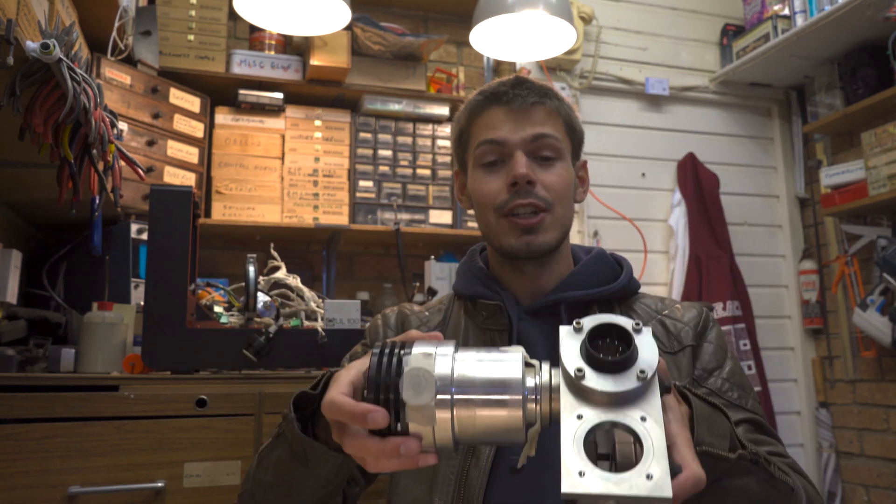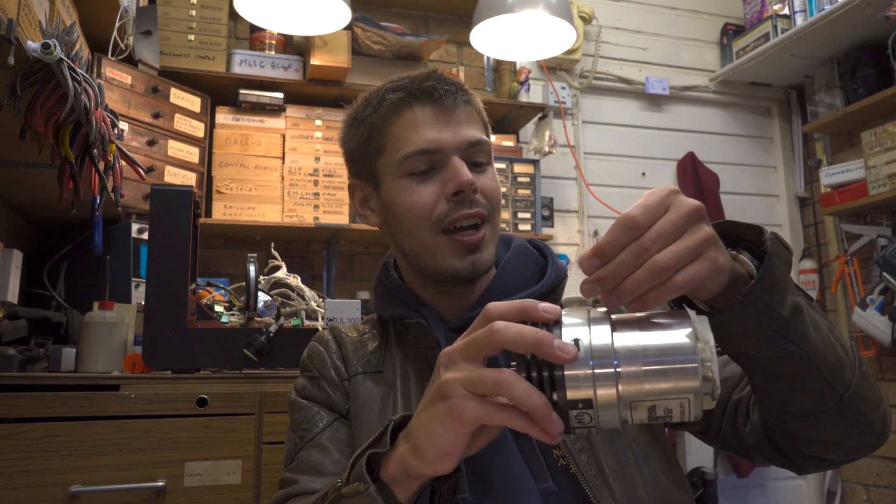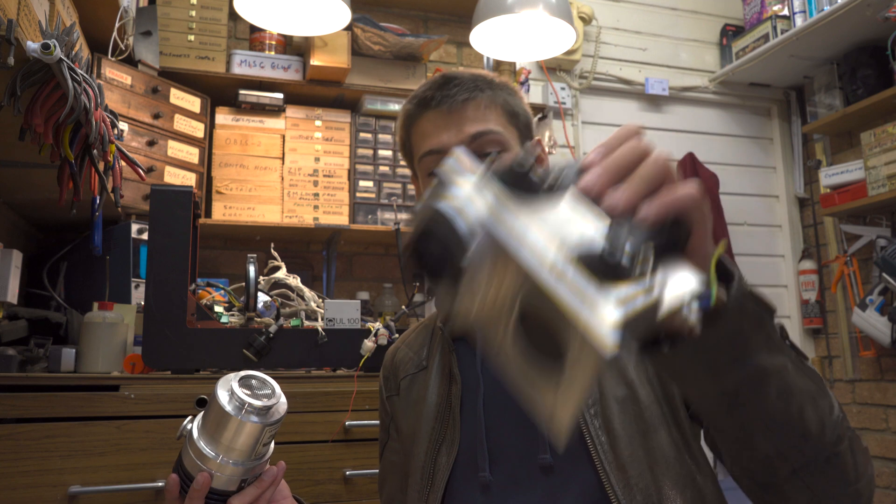So how do we make a high vacuum? You use a high vacuum pump. This is a turbo molecular pump, which is basically just a fan that spins really really fast to impart kinetic energy into the molecules of air, in hopes that they will bounce out of the chamber. This is attached directly to the mass spectrometer and sucks all the air out. This fried my noggin for a bit because in the mass spectrometer there are no other holes or ports for helium to get in — so where does the helium that's going to be detected enter? It turns out it's via reverse diffusion, because helium atoms are so small they can actually diffuse through the pump against the flow and make their way into the mass spectrometer chamber.